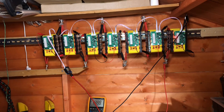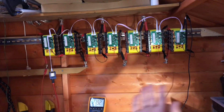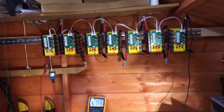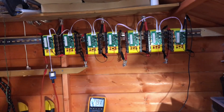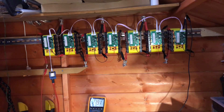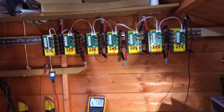I'll need to keep an eye on this and check whether it's managing the pack effectively. Coming to the end of this video, I've made good progress — I've chosen 22 ohm resistors, fitted thermistors, and provisioned and calibrated seven modules. The cells are pretty much in balance for now, and they'll stay that way since I'm not charging or discharging. In the next video, I need to hook up solar panels and a controller, take some energy out, and then we should see the real worth of the DIY BMS. Thanks for watching!